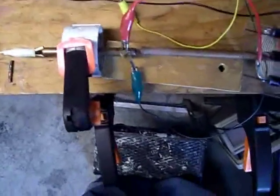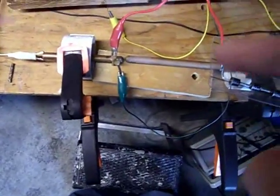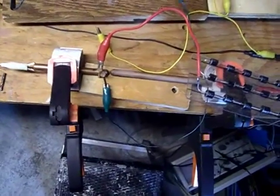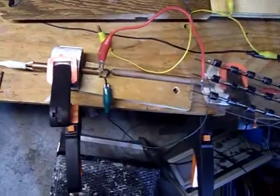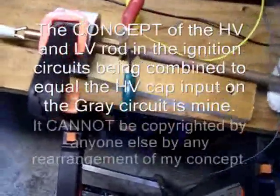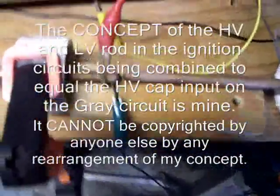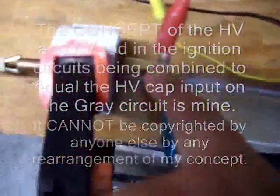Now all this setup is pretty much the same. If anybody understands the plasma ignition circuits and why I'm using that to discharge a cap on the back side — that 1,000 volt charge in a 4,000 volt cap being discharged over a gap is equivalent to the front side cap being a big capacitive discharge. What I've done is added two points, so those two points really equal one large cap.